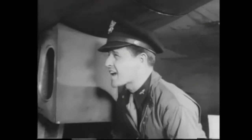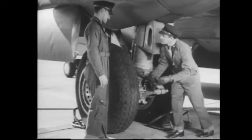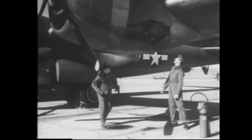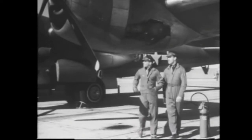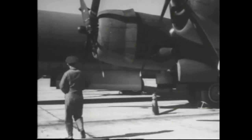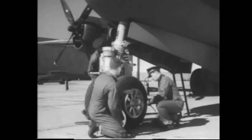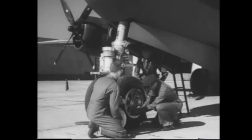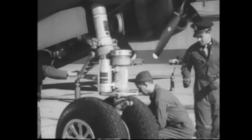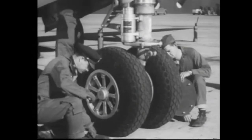Here's a B-29 pilot. He's measuring the distance between pin centers on the left landing gear. This part of the job isn't so glamorous, but it's the pilot's responsibility to make sure that everything on this biggest bomber in the world works properly. If you were a B-29 pilot, here's exactly what you'd have to do before an operational flight: check the nose wheel, see that the tires are inflated to 45 to 50 pounds per square inch. While measuring the pressure, look over the tires for general condition also. Watch out especially for cuts or signs of serious wear. One of the ground crew will replace the dust covers, but you're still responsible for his work.